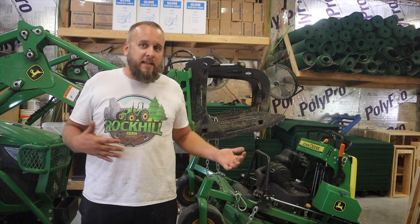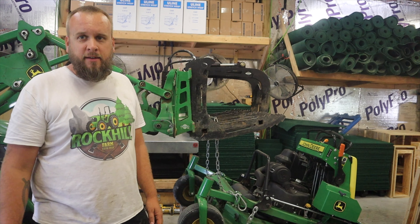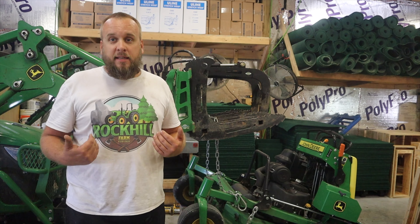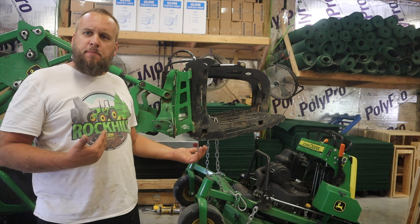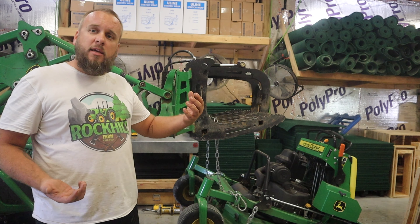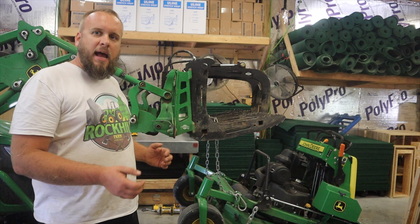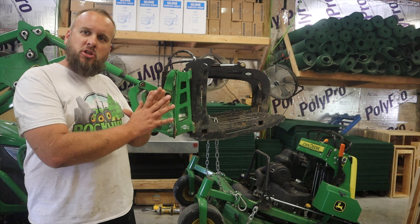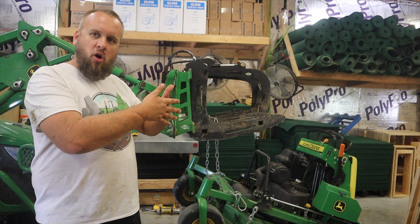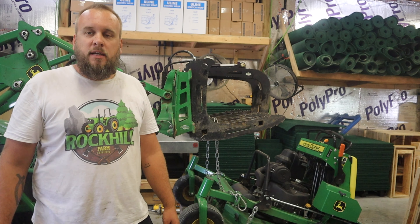When I started recording this video 15 minutes ago, the purpose was to talk about the failure of my electronic mulch-on-demand and whether it was an indictment of the system or just a fluke — turns out it was completely my fault. What happened was I lifted the mower up to put those Megmo blades on. I slid two concrete blocks under the deck to protect it from falling on me. Whenever it got pressure on those blocks, I hadn't placed them well enough — I was actually working in the dark, which was stupid. One of them pushed on that mulching flap and shoved it onto the wrong side of another deck component. So when it tried to open, it was up against a solid piece of metal and there was no way for it to function. And it slightly bent one of the rods — I straightened it out. Hopefully that continues to work.